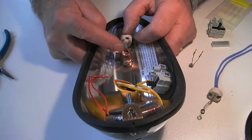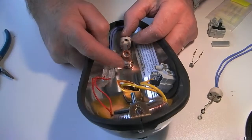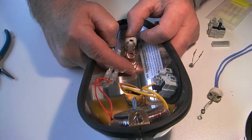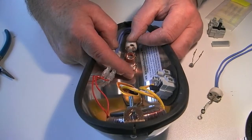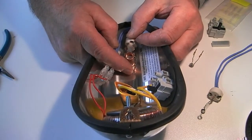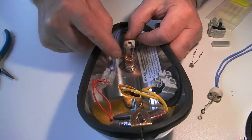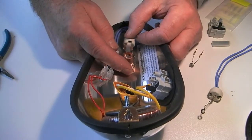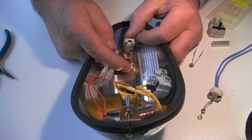The coil must be centered exactly in the middle of the lighting tube, so that the glass tube itself that holds the coil slides up and down quite easily in that spring clip. You can see how it moves quite freely, firmly but freely up and down. You can visually see the coil through the glass tube, and that way you'll be able to center the coil exactly in the middle of the lighting tube, and that's where the most heat is located.